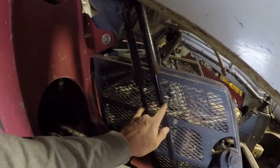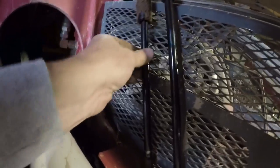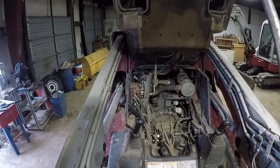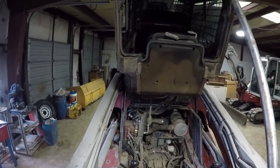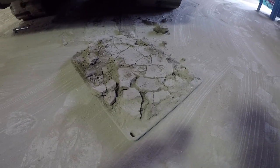Speaking of cylinders — this machine's got four big cylinders that lift this cab up. You can kind of see this residue here — these are shot. And this cab is heavy. So I may be running back down to Victor Phillips to get four more cylinders today, because you can hardly pick this cab up by yourself if those are shot.